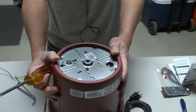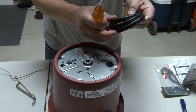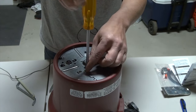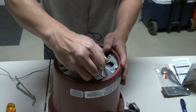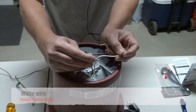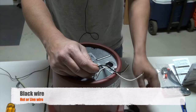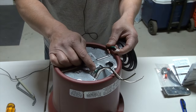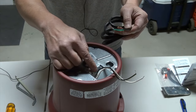One factor that kept people from installing the disposal themselves is the wiring, but it's actually very simple. For the disposal, the wires are kept underneath here. You need to remove this panel to have access to the wiring of the electric motor. Here you have two wires coming out — the white one is always a neutral wire, and then you have a black and yellow wire which is the hot wire. You connect it to the hot wire of the wall. In the middle here, you see a little green screw — that is for ground. You always need to connect the ground so that in case of a short, electricity will go through the ground.